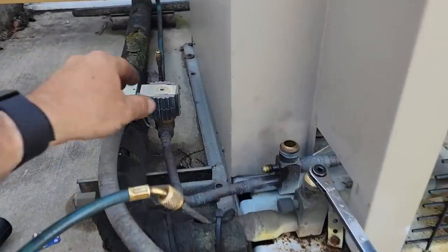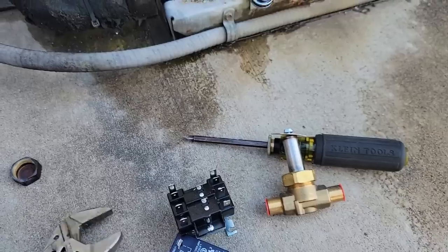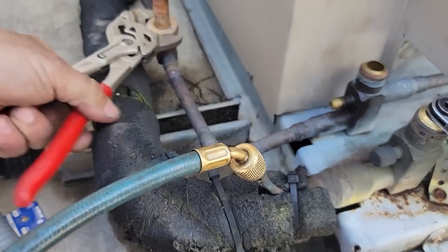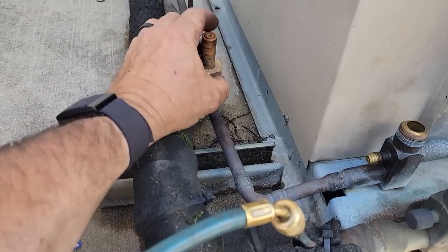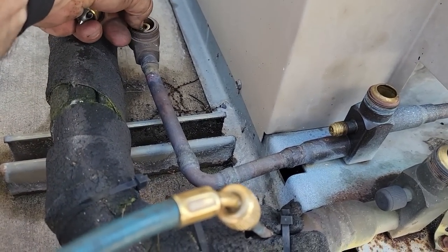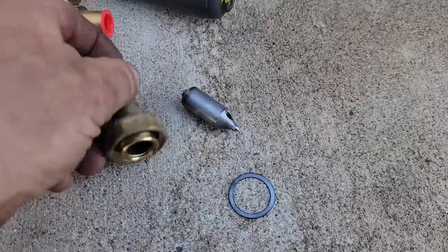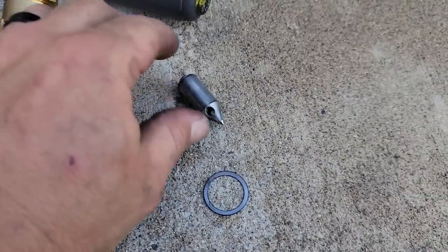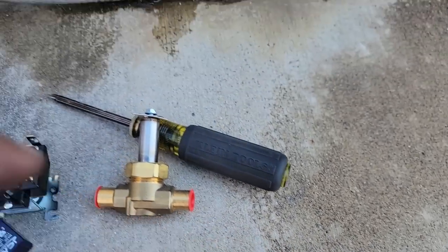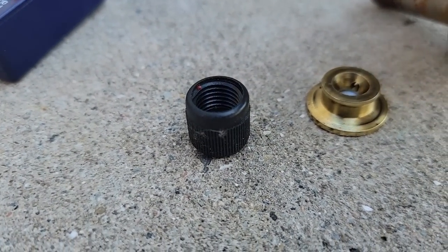Now let's go ahead and get started with this thing. Unfortunately, the only type I have is these brass ones — I hate that because it's a pain in the hiney. To get it to stick you've got to use the high silver content, use the special flux — just not very friendly when it comes to brazing it in. I can't remember if I replaced this one already once. I'm not sure why this one's sticking, but there is not a whole lot to these. There could be something on the tip of it sticking. I'm not taking a chance — I'm just going to replace it.